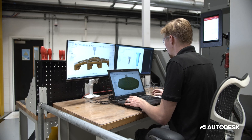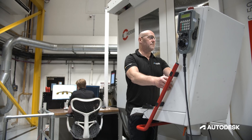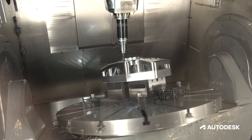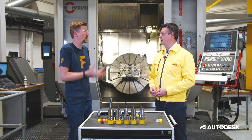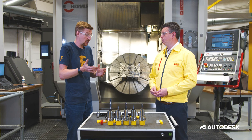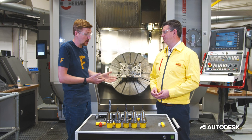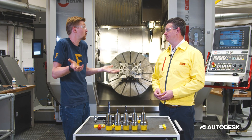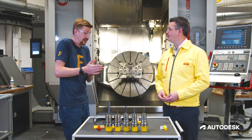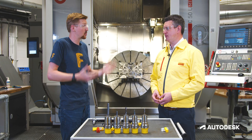As programmers and machinists, we have to balance length versus tool axis limits. On a five-axis machine we can manipulate the machine to avoid collisions, but we'll reach a point where we hit limits, or we might avoid the collision with the tool but then have a spindle nose to table collision. It's about balancing the degree of deflection we're willing to accept against the machine limits and other parameters around there.